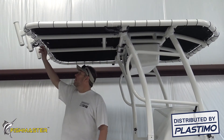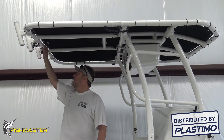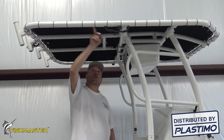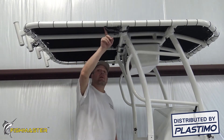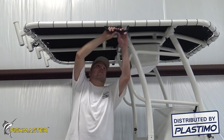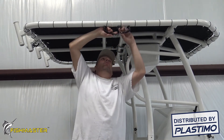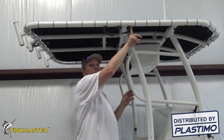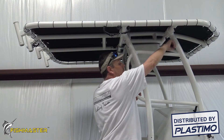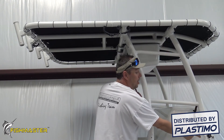In summary, what we did is came into the tubing here at our navigation light and our spreader light, went around the tubing, came out at the break — make sure you stay two inches back from the welds — used a quick disconnect here for our wiring, came back in on the other side of the break, around through the tubing into the side upright, and down into the console.